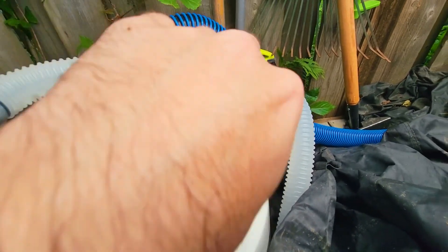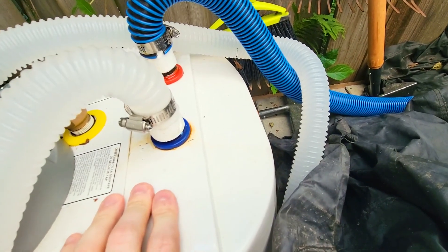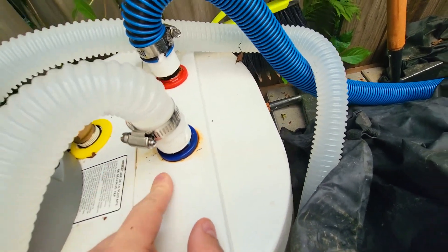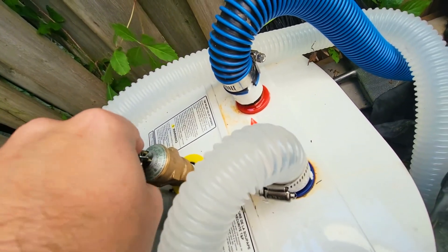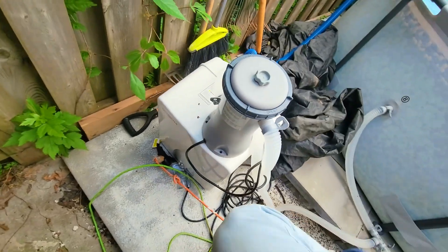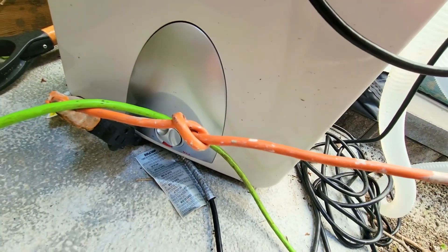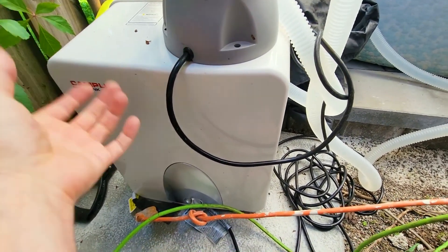This is a three-quarter inch adapter that we inserted into this plastic hose. On top of the tank there are three-quarter inch garden hose connectors — you do need to retrofit it with an adapter, which is what we did here. That adapter is only about $1.50 at Home Depot, and the clamp was another dollar. There is also a safety valve to release hot water if it gets too hot, but this will never get too hot — it goes up to 125°F, which is about 50°C.